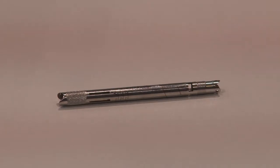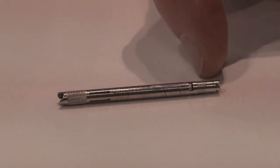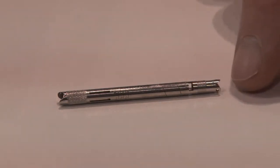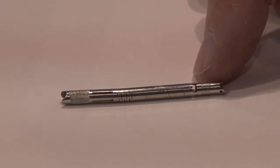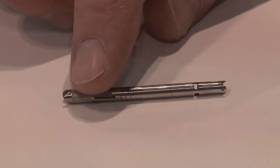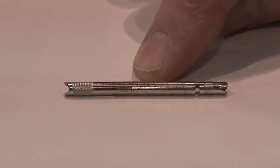We can see the part and how it's manufactured here. As I mentioned earlier, we do a chamfer on this end, then we do some conventional turning, put a conventional thread in, and then we laser cut these features along with the holes and square cuts. You can see the spiral here, as well as — it's kind of hard to see — but we laser engrave our name into it.